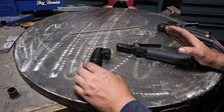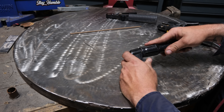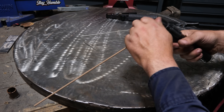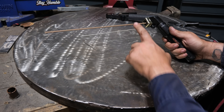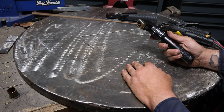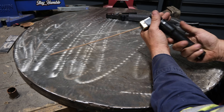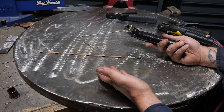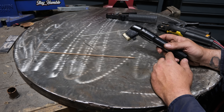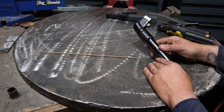These are unconventional stingers — and for those overseas you might be more familiar with this style. This is a twist-lock stinger. You actually rotate the handle to pinch a rod. You put it in, tighten it, and the rod is held in the jaw, and you can reposition it by bending the rod in any direction. If you stick a lot of rods, you'll need to quick-twist and pull to unstick, but once you get used to it you do it automatically without thinking.